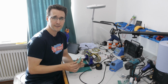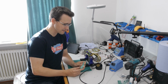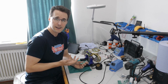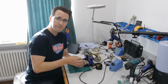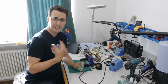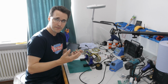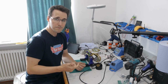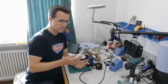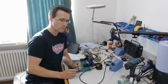On the PCB for the ADF panel I placed the resistors directly, but there are some disadvantages in this method. The first one is that when I want to check which resistor I have used, I'm not able to reach it easily to measure it with a multimeter. I had to disassemble the panel from the pedestal and then go in there with a multimeter, and I was lucky enough that I could reach this resistor. Otherwise I would have had to dismount the backlighting panel and so on. So this is one thing that I don't want to have.